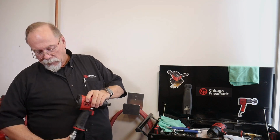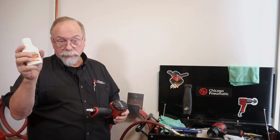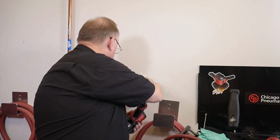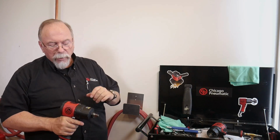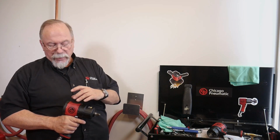Okay? Now, what you do is you unhook your tool, take your bottle of oil, open it up. You don't need very much, so I don't spill any here. You just give it a couple of drops, 3 or 4, doesn't need very much. Hook your hose back up, okay, and you burp it. That's all you do. What that does by running the air motor with the oil in it, it atomizes the oil into the vanes, seals, and bearings and blades of the air motor. And then you unhook your tool, put it away for the night, and away you go.